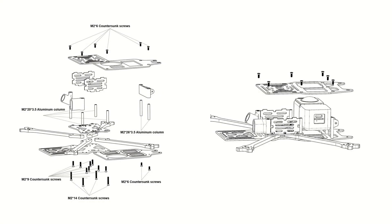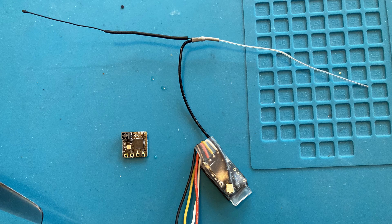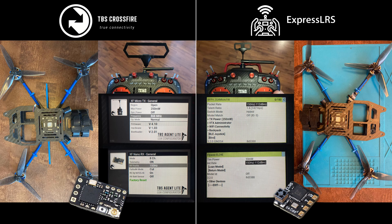This being an invisible drone does limit the antenna mounting options quite a lot. So I decided to swap out the Crossfire Nano for the amazingly small ExpressLRS EL24E receiver with the built-in ceramic antenna. I set both the Crossfire and the ExpressLRS TX modules to 250mW and fixed to 150Hz. The difference is of course that the Crossfire is on 868MHz while the ExpressLRS is on 2.4GHz.